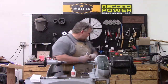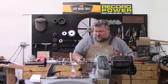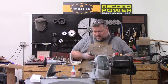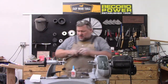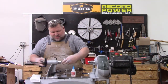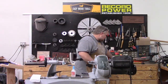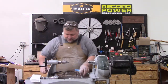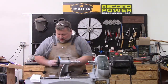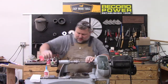You're welcome. I'm going to put in the dead center, because I like to do CA without bushings, because it's really easy to glue your bushings in. And so if you can do it without them, it's nice. All right, so get that in there. And we just want to kind of sneak up on this guy, lock it down.